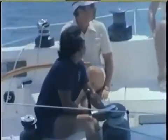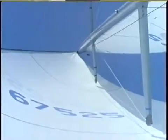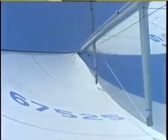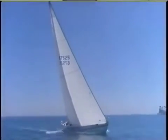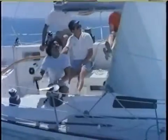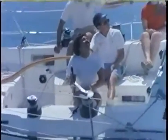The best guide for reproducing the best sheeting of the Genoa in various conditions is the distance of the sail off the spreaders. Mark the spreaders with tape at 6 and 12 inches for a scale of measurement, and use boat speed and relative performance against other boats to judge optimum trim. The Genoa trimmer will adjust the sheet for small gusts or lulls to keep the genoa a constant distance off the spreaders. The most common error is to over-trim the genoa.